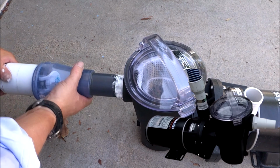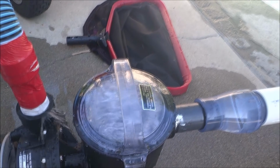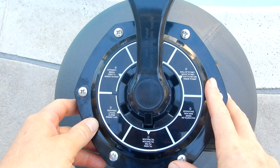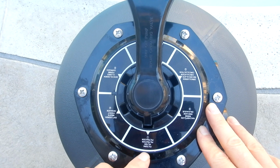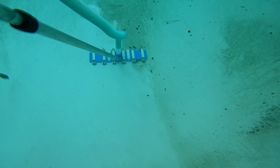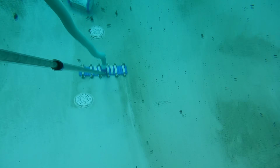I really prefer using a portable pump. I have a video on my channel that shows you how to build a portable pump for under $300. You can use this to pump out your pool. If your filter doesn't have a waste mode, if you have a cartridge filter or a D.E. filter without a waste mode, this is a great way to get the ash out of the pool. You will lose some water, but you'll get the ash out of the pool without clogging up your filtration system.